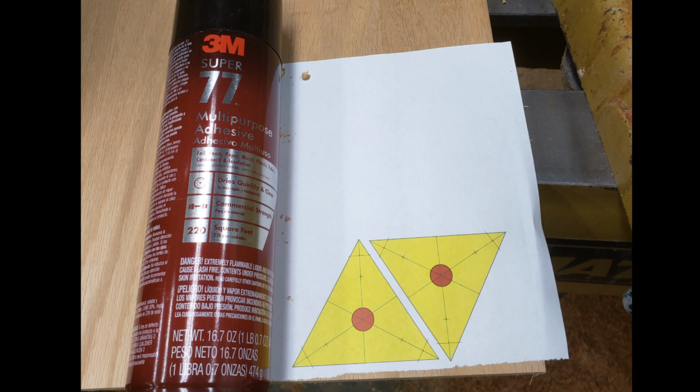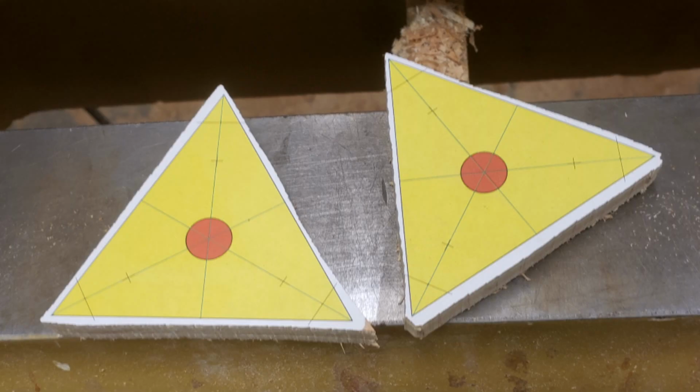Then this pattern is printed on plain paper. Using spray adhesive, the paper is glued to some 1/2 inch plywood and rough cut on a bandsaw, staying outside the lines. Then a large disc sander does a quick job of sanding exactly to the line. At this point also, I use a Forstner bit to drill the depth of 1 washer at each corner, then drill a pilot hole for the screw that will clamp the 2 washers on the wire at each corner.